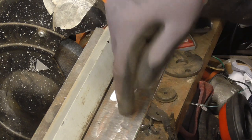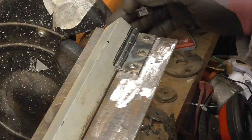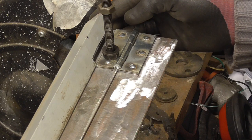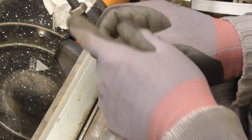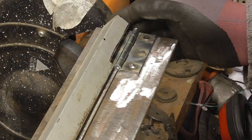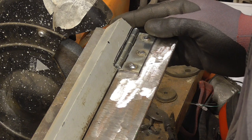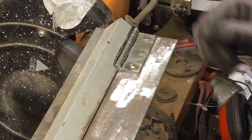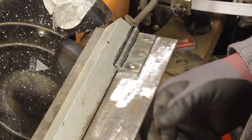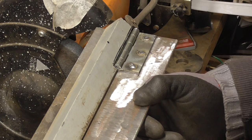To attach the angle to the bender we're going to use a couple of tensile bolts - drill a hole through here, the bolt's going to be attached on there, and then in theory this will sit down on top and we can use the nut to clamp down the bar and clamp the sheet metal before it's bent. Position-wise, rather than going exactly on the centre line I'm actually going to bring it forwards very slightly - about a millimetre - so the hole can't be seen along the line. The reason being: when I fold it up, the gap down there is about 2mm, and I can't see myself bending steel any thicker than 2mm, so that's the gap I'm aiming for for a nice tight bend.